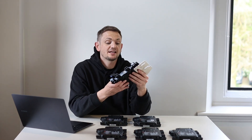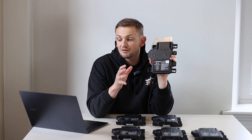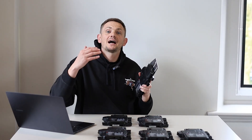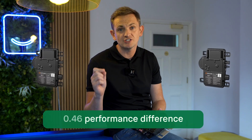That brings us to the IQ7A, the third iteration of the IQ7 range. This product is rated at 366 watts — the most powerful IQ7 on offer. However, its operating voltage range increases by 2 volts, so in low-light settings like the UK, the IQ7 Plus actually performs better, while the IQ7A has an advantage in high-light settings. Enphase published their own comparison test between the IQ7 Plus and IQ7A, conducted in the Netherlands using a 420-watt peak module over 12 months.